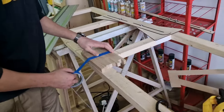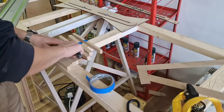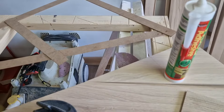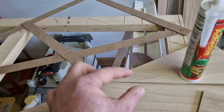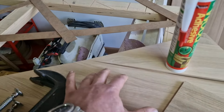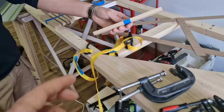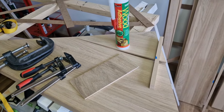We will put some tape just to protect it from gluing wood to wood. As you can imagine, these two pieces in the workshop are solid oak, as is this. We don't want these pieces sticking to our material, as when we try to take it off it might splinter or chip the nice side of the material. So that tape will be put where the joint is — if any glue comes out it will stick to the tape, which is a lot easier to remove than two oak pieces glued together.